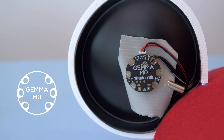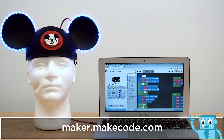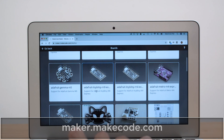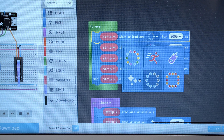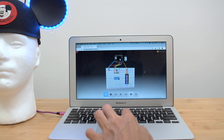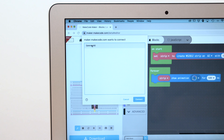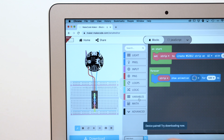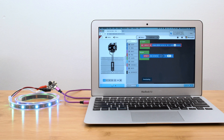This is a much simpler build and doesn't need a lot of wired connections. If you're just getting started and looking to get your projects up and running, definitely check out Microsoft's MakeCode — the maker version supports a lot of boards from Adafruit and the open source community. The user interface is nice and simple, and there are a lot of great examples and built-in LED animations. You can use the simulator to test your code and get auto-generated breadboard wiring, making easy-to-read circuit diagrams so you can follow along while you prototype. You can plug in the device via USB and upload code directly from the MakeCode website — any supported board from Adafruit can pair with the device via Web USB.